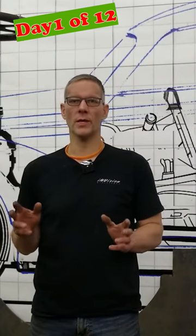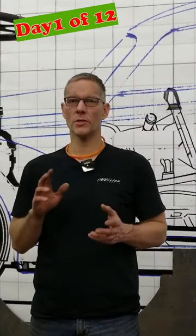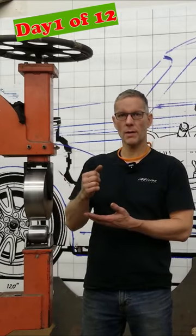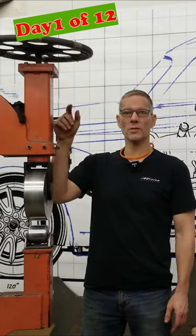If it's a few small panels over the weekend, one time thing, you can probably get away with a smaller English wheel. But you have to make sure that the frame is stiff enough so that these wheels compress the metal properly. As you turn down the adjuster and the frame separates, it's not going to give you the results you want.